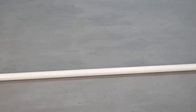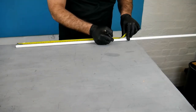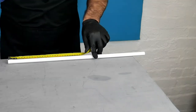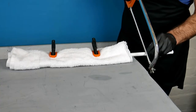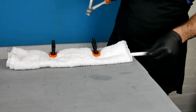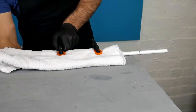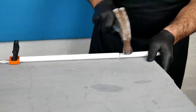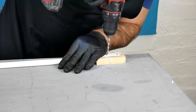For the handle I'm using curtain rail. I don't have any brackets for the curtain rail so I'm going to improvise. I measure out the curtain rail to the length that I need and I cut it off. I measure out each of the side pieces that will be attached onto the trolley. I cut the curtain rail most of the way through on both of the marks, and then I flatten one side. I clamp down the flattened side, then I flatten the other side, and I drill the holes where it's going to attach to the trolley.